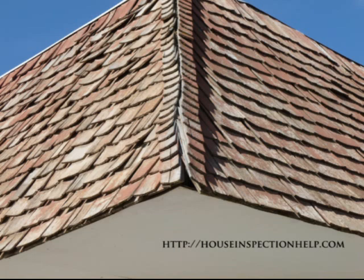You can see this is over a soffit area, and it looks like it's kind of a mansard roof, where you might not see the results of the water damage on the interior of the building — you might see it on the outside. It doesn't look like we're seeing any problems, and that could be because the ceiling on the outside is painted regularly. Who knows — maybe this isn't as bad as it looks, but it looks pretty bad.